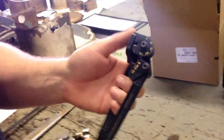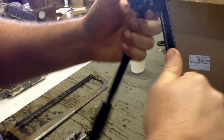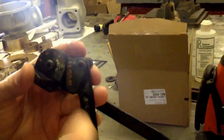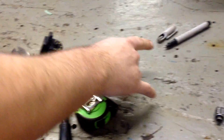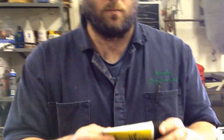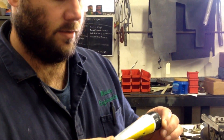We've got our quarter inch tubing bender here made by Parker Hannafin. It's a pretty neat little device that lets me make 0 to 180 degree bends, really precisely, makes it look nice and good. We've got a tape measure, sharpie marker, and then I've got this Tough Set high performance pipe thread sealant. This stuff is really good - we've used a lot of different ones and this is the best one. It's rated for 10,000 PSI, 40 to 400 degrees Fahrenheit.